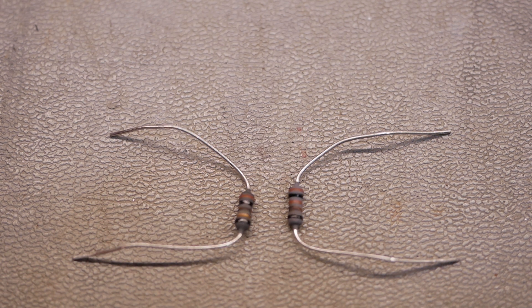And here are our two fusible resistors. You can see one is worse than the other - the gold band on one of them has gone a dark brown. But essentially the package is intact, and it wouldn't have caused any damage to the surrounding circuit board or other nearby components. So that's why we use these for certain applications where they're likely to be abused.